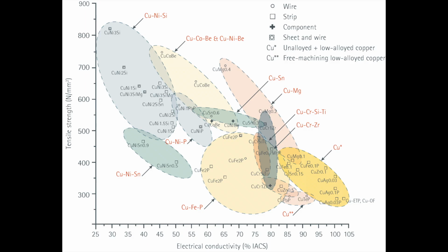You have to make sure that if it's gold contact, it's gold touching gold, and they're the same hardness so they don't wear each other out or rub it off. Then underneath that, you need something that's also conductive and hard and will help that material stick to the copper material without altering the properties of each of those by electron migration and things like that.